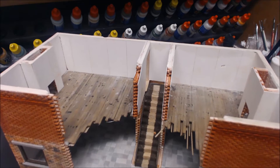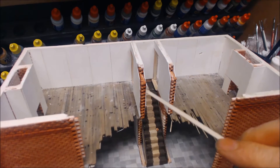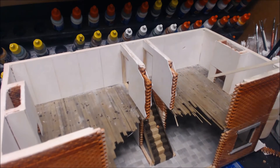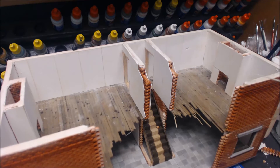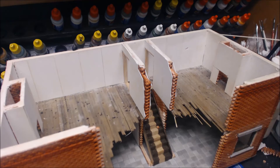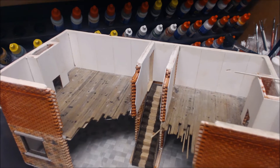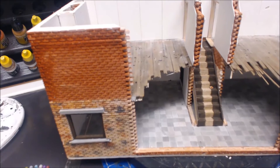That's another bit finished — we've got all the plasterboard on in both rooms and in the stairwell as well. I just wanted to get it all finished off with no bits left here and there. The fireplaces have been boarded out, and I'm going to do a bit of research to see what sort of fireplaces they actually had. I've also run a bit of filler around the top where I chopped the course off for the wall plate. All that's left now is a little bit of filling and sanding.